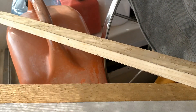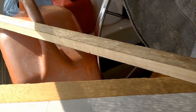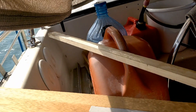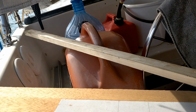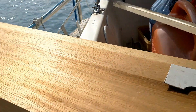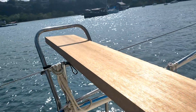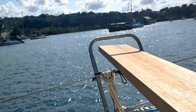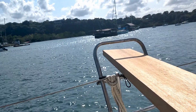The bulk of the material I'll remove with a big chisel and mallet. Once I get that done and smoothed down pretty well, it's time to go to town with the grinder and a flap disc — I've got a stack of ten 40-grit discs for shaping. Not a bad job, I don't mind grinding wood, although it'll get sawdust everywhere. When that's all done I might taper the trailing edge, cut it back at an angle towards the top, since I don't really need that full width strength the whole length. I did that tapered cut on the other auxiliary rudder and it never gave me any problems — it helps reduce the overall weight.